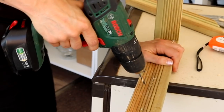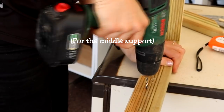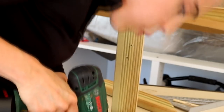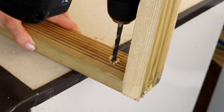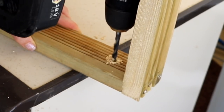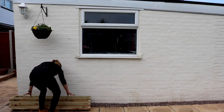I initially pre-drilled two holes for the piece that goes against the wall but found I could only use one. I was fine with two screws for the top though. For the holes to hold it against the wall, I pre-drilled two larger holes in the exact same place on each bracket for the spec screws to attach to the wall.